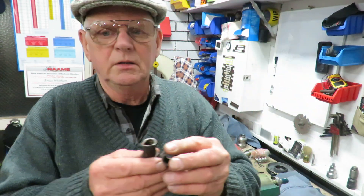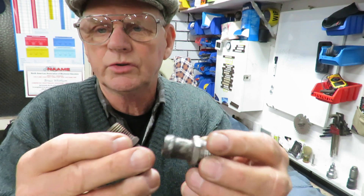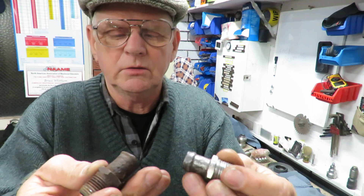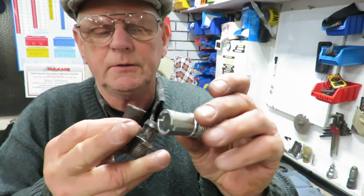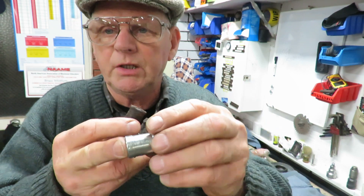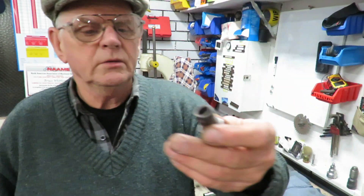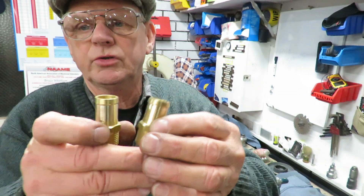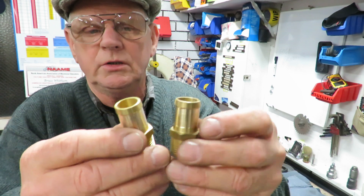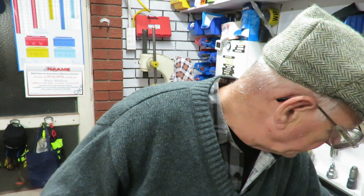Another job was a couple of old hose fittings out of a relic vehicle. I was requested to produce some new ones - there was a new one they had but it's BSP and they need NPT. I just had that particular one cleaned up, and I've made two others from NPT bushes - machined them down, cut the grooves and so forth. That's now ready for delivery.